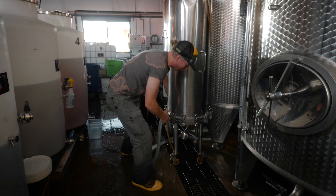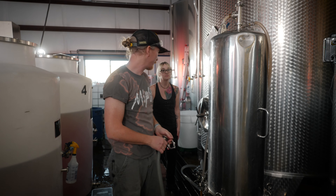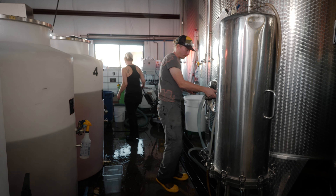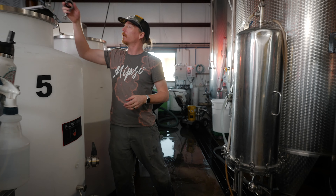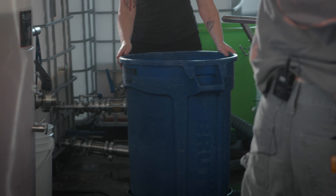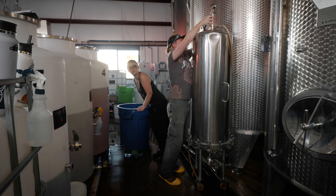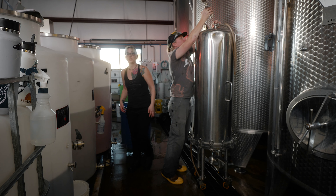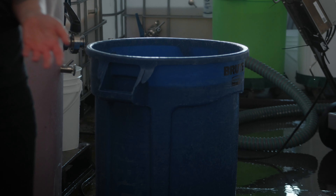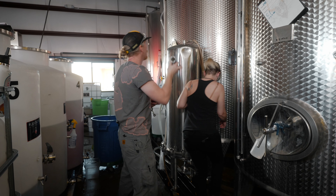We're just about there — it's still a little warm. So now we're going to drain this thing, put a gooseneck up on there, and as soon as we have a pump available we will sanitize the filter and be able to start running again. This is our sanitizer — it's basically a combination of water and peracetic acid. It's one of the more gentle options we can use for a sanitation process. There are way more volatile options, but this is the safest for us to use. It just takes a little bit longer, but it does the same job.